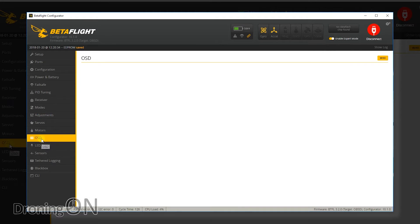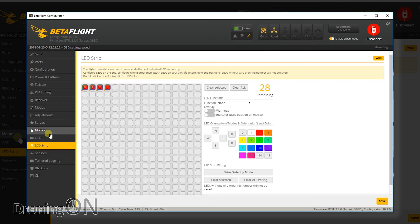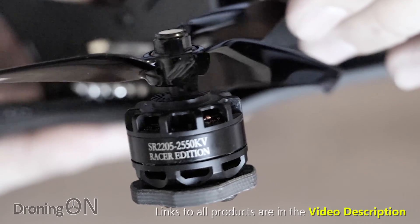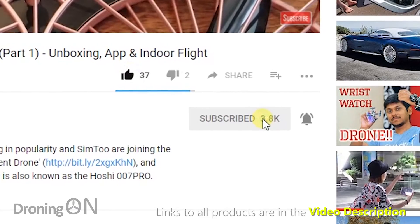On the OSD tab we've got the on-screen display provided by Betaflight — we don't need the artificial horizons or sidebars, just moving a few elements into the corner and saving. The LED strip can be customized as much as you wish. In the CLI, typing 'version' shows we've got the Omnibus F4 running Betaflight version 3.2.0, which is a very recent version. That's a quick fly-through of Betaflight — we've simply configured it ready for flight. Due to bad weather we struggled to film the flight test until just recently, so look out for that uploaded hopefully this weekend. Take a look at the Dark Max 220 via the links in the description, give this video a thumbs up, and click subscribe — thanks very much for watching.